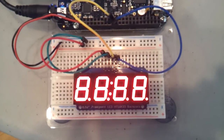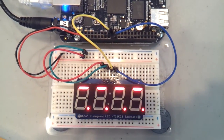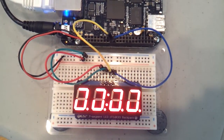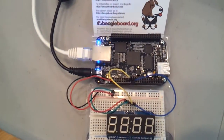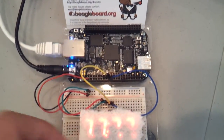It's just going through a sequence here. This is a 7-segment display. I also have the LED matrix connected, which also connects via I2C, so I'm going to try that out as well next. It's a pretty nifty little display — just data and clock, then 3.3 volts and ground, so it's a pretty simple connection.